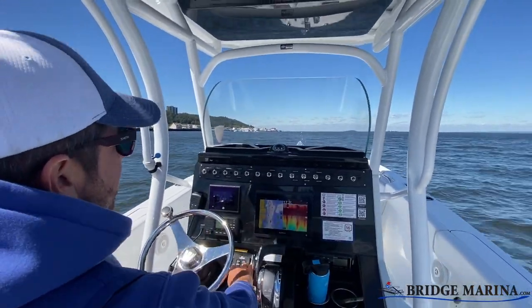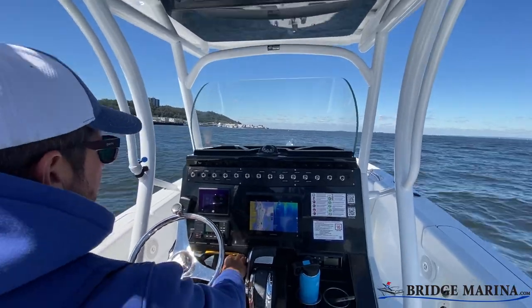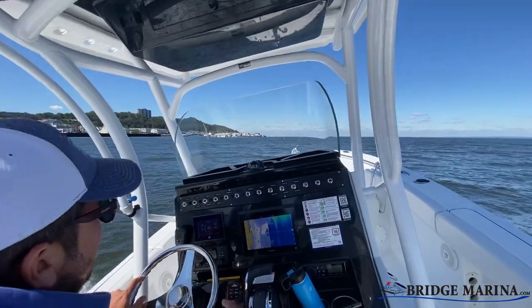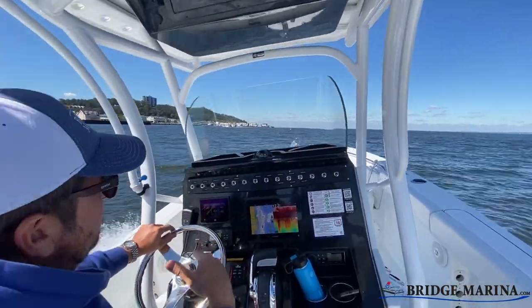So it's making us lean to our starboard side. I'm going to raise that tab up and go down on my port side. We're going to see the boat lean to the port side now pretty heavily — and now I'm leaning port with my trim tab.